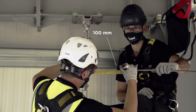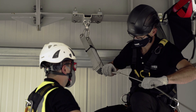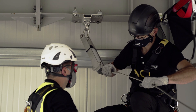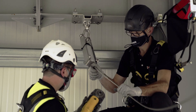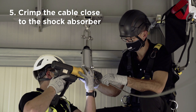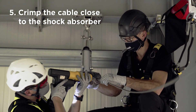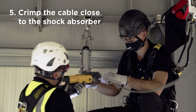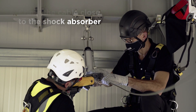Put a mark 100mm before the end of the cable. Insert the cable up to the mark into the 200mm crimping ring. Crimp six times with the 200mm crimping ring LDV-010. It is recommended to change the orientation of the machine when you crimp, to avoid deformation of this longer crimping ring.